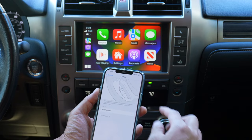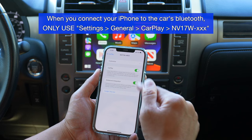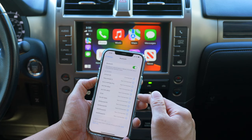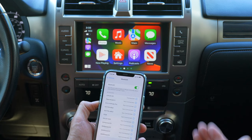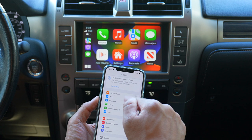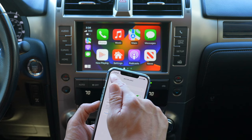The phone connects to the CarPlay device faster than to the car's Bluetooth, so if you're playing music you might briefly hear it from phone speakers until Bluetooth connects. Important: when connecting your phone, only use the General CarPlay menu — never go directly to the Bluetooth settings or Wi-Fi settings. If you go to Bluetooth settings it won't show the device as connected, because wireless CarPlay uses a different type of wireless connection, not standard Bluetooth or Wi-Fi.